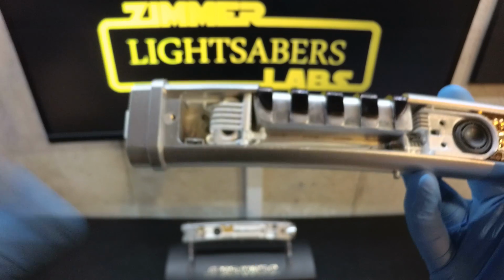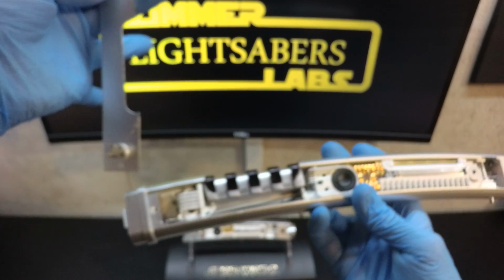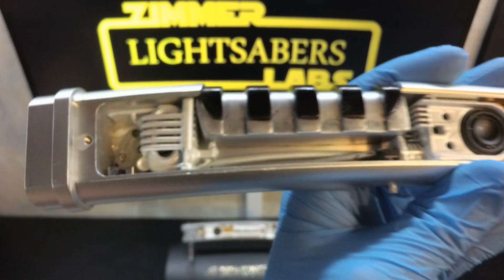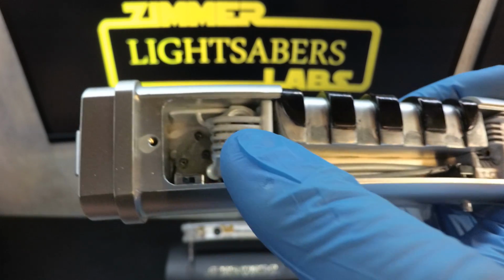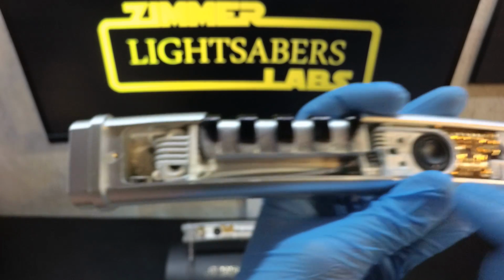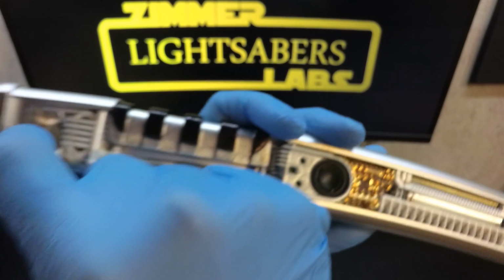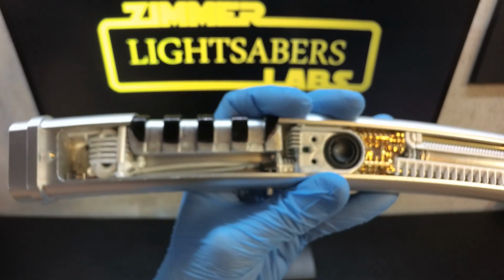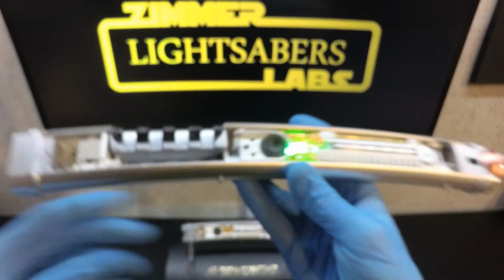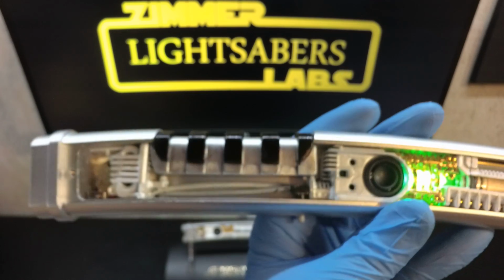I mean, I could have just wired it up so that you could pop this off and there would be enough wires that you could have this over on the side with the wires connecting it, but that just looks terrible, let's face it. But that also means that when you take that off, this recharge port / kill key no longer has any connections, meaning no power is getting to your sound card. So you've got to install an additional switch, which is right here, this little tiny guy. And you'll notice that I flick that switch, and we've got power again. So now you can display this wide open, no wires, no side plate, nothing ugly to get in the way. But it took a little thinking, and it was a little tricky.